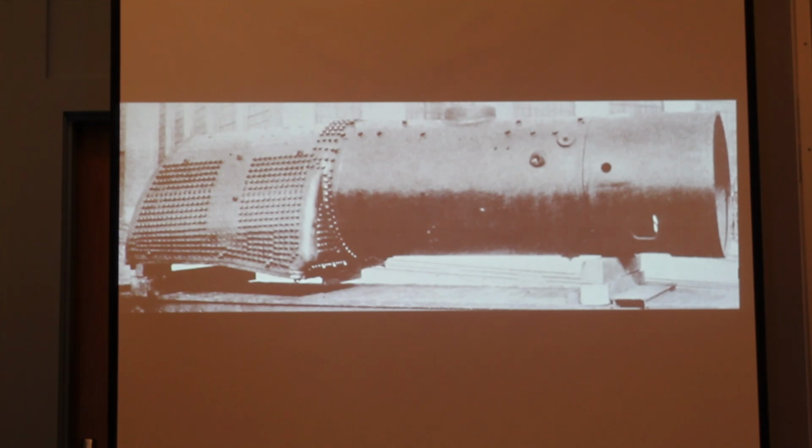Based on everything I've read, the welded boiler was highly successful. It cut way back on maintenance. A steam locomotive's biggest maintenance item is the boiler. The N&W demonstrated with the J's, and then the last 5 A's, roller bearing rods, all that stuff. You could just run them and run them and run them. The maintenance was on the upper side. But the welded firebox and safe ending flues certainly made a positive difference in the maintenance costs, and the all welded boiler made a huge difference. Way less maintenance, still maintenance, but way less than a traditional riveted boiler.